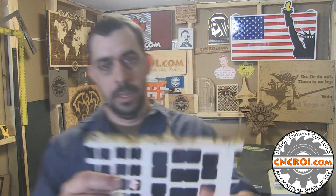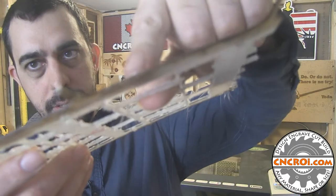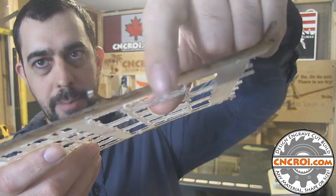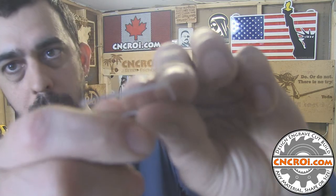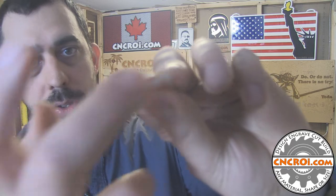On the edge here you can see this was laser cut — other parts that we did. You can see the edge quality is like a black sandpaper sort of touch. While the one done with the CNC router — this is a scrap piece so it's a little bit rough — is not optically clear but it's like a sanded sort of clear.